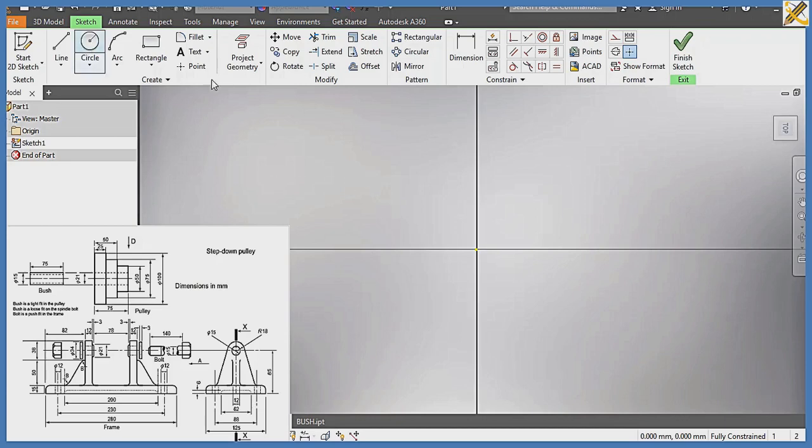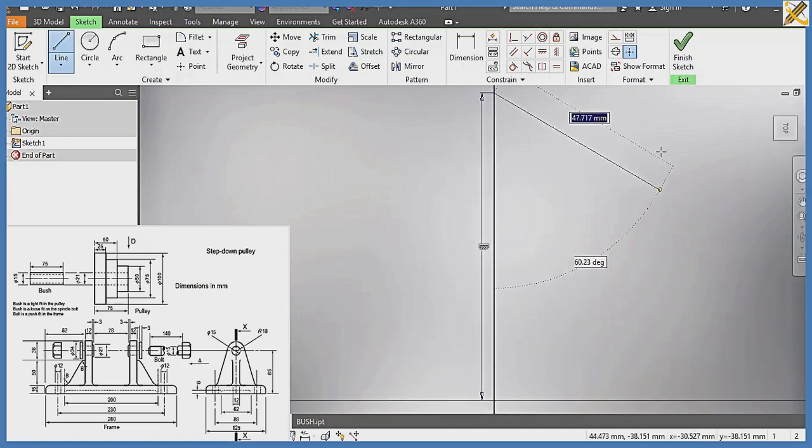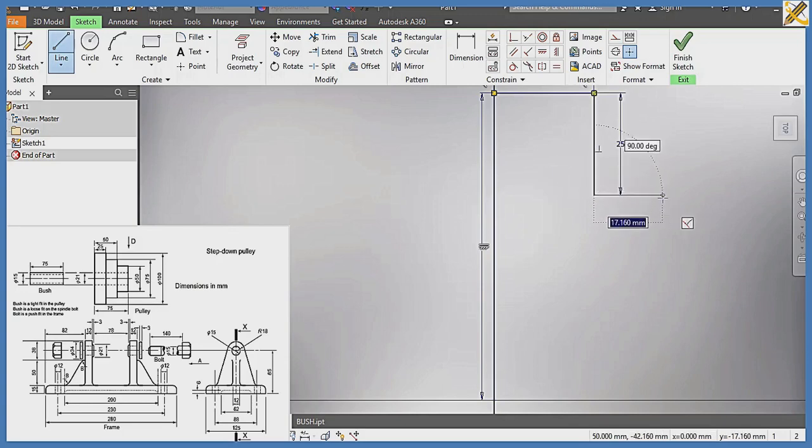If I'm using the revolve command, the biggest diameter there is diameter 100. The total length of the pulley is 75. Starting from the top, the smallest diameter is diameter 50, which is radius 25. Enter. Our height there is also 25. Coming down here, the next diameter is 75.